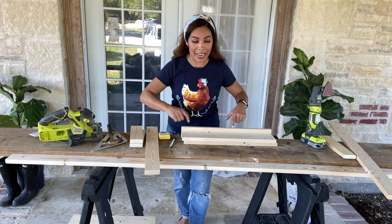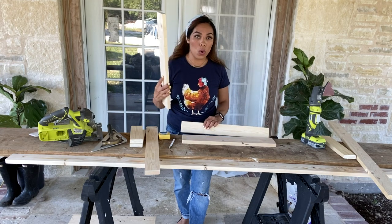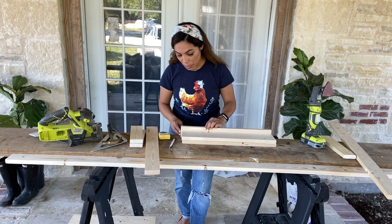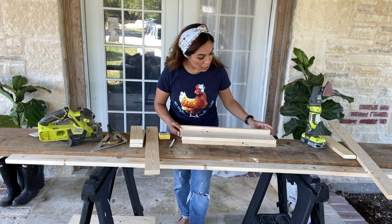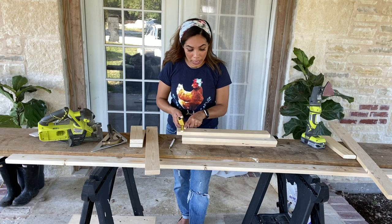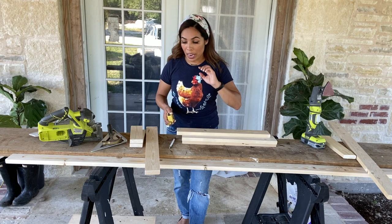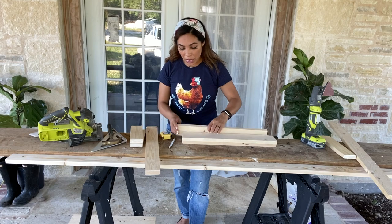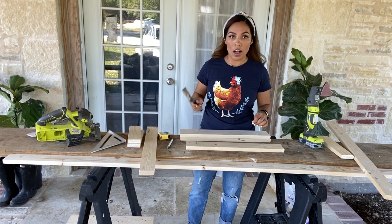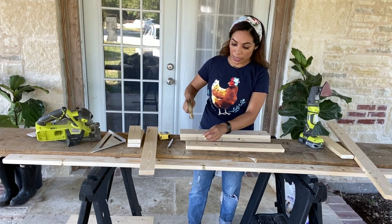The next thing I'm going to do is nail all of the side pieces onto the table. Line up your two 20-inch one-by-fours on top of each other, then line up the side piece. The measurement is one and an eighth, and I made markings along this side of the board so I know where to nail the finishing nails. I'm going to start by pre-nailing — getting the nails started on the marks but not all the way through.